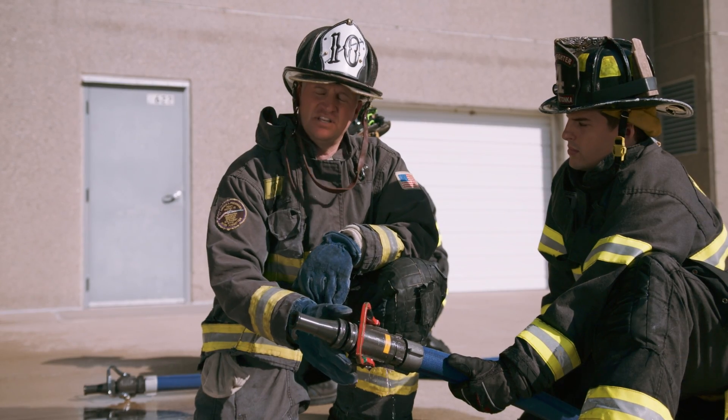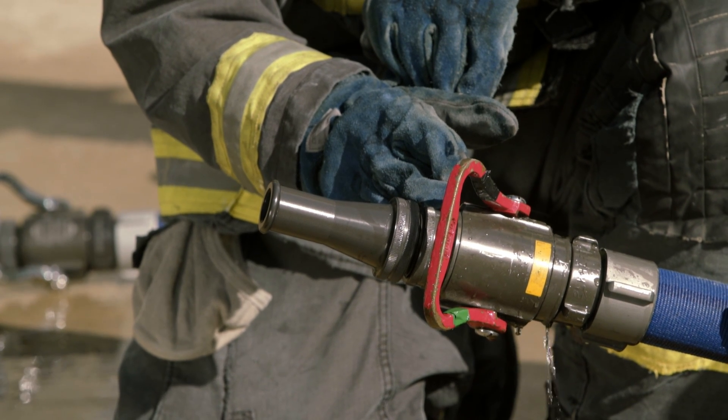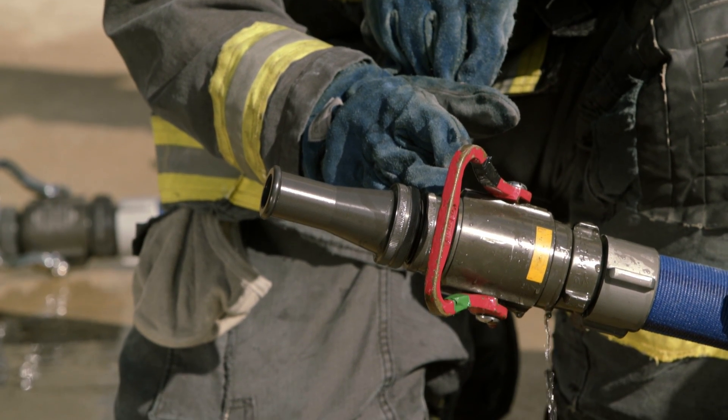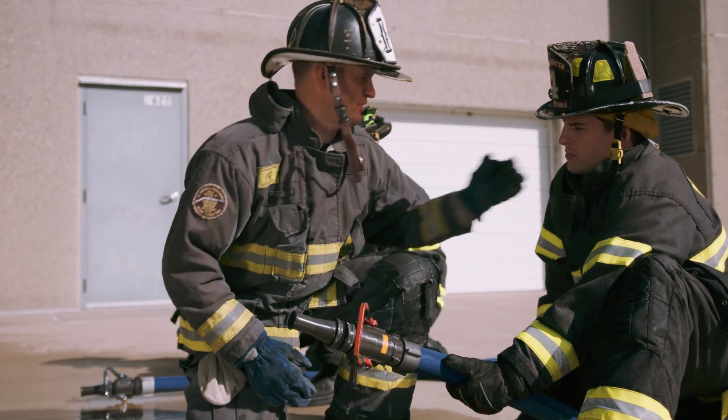Once again, we're going to see improved stream quality, but the vanes added by this appliance now eliminate the ability to freely clear debris, pass ice, or any material that might be traveling through our hose system. Go ahead and open up.